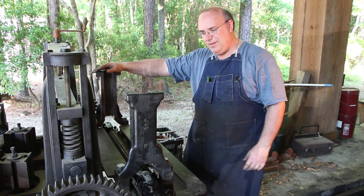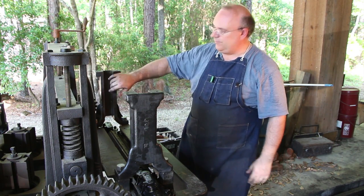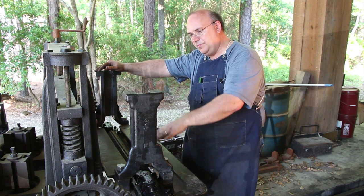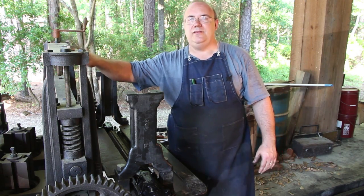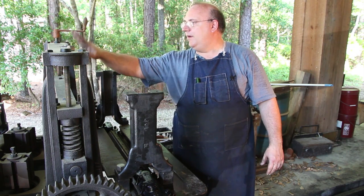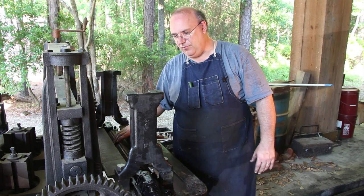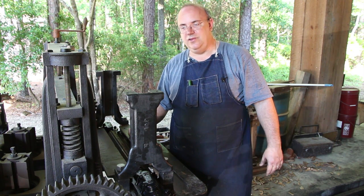One more step down on the Vance matcher restoration project. We have the stanchions installed, new bolts made, everything machined out and ready for the hold-down bar. The next step will be to start machining that rough casting for the pressure plate. We've also got to make another one of these pieces on top — I had to have a casting made for that as well, since the original was gone when we got the machine. We still have to machine it and put elevation screws in like we've done on the other ones. We're well on our way to getting the upright pressure plate finished up, so thank you for watching and subscribing to my channel.